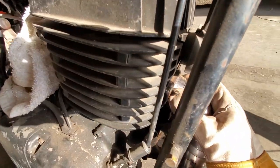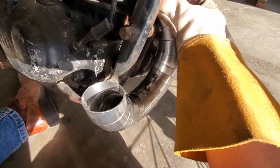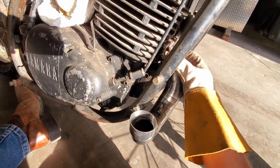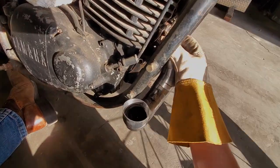Here's a proper mock-up — got the flange in there, got the pipe coming out, and here's where the expansion chamber will start. We're back again another day. Last time I tried a little bit of welding but it's pretty hard, so I'm going to get some practice on some scrap real quick and then go for it. To do pie cuts properly, there's actually a sequence in which you want to weld — you don't want to go on one side the whole time first because that'll put too much heat in one side and end up warping your tubing.